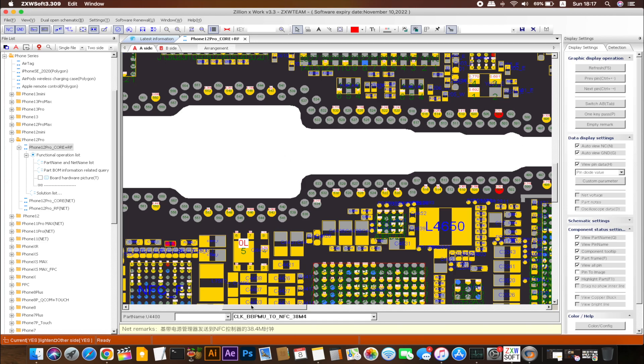So this pad goes to NFC, then we have Wi-Fi from the CPU, also Wi-Fi, Wi-Fi, Wi-Fi. Those go to the baseband PMU, camera, and those are also Wi-Fi. As you can see, most of the lines or most of the pads are Wi-Fi. So we are going to renew all the pads, and after we finish everything we are going to test in the board tester to check if we have our Wi-Fi and Bluetooth back, and after that we'll see how it goes.